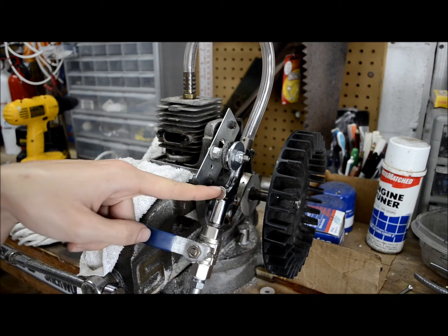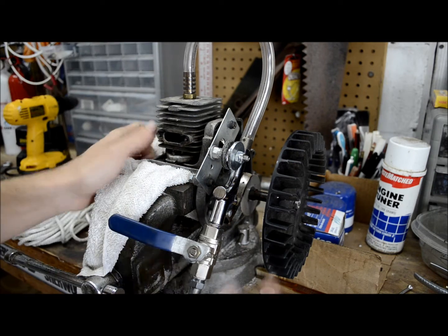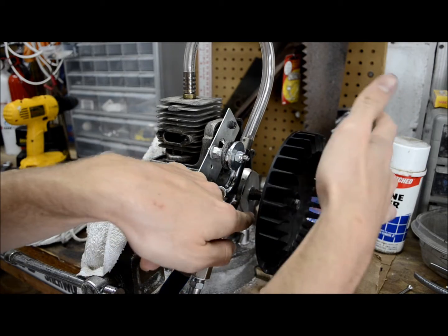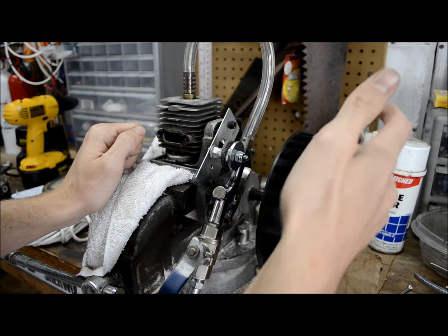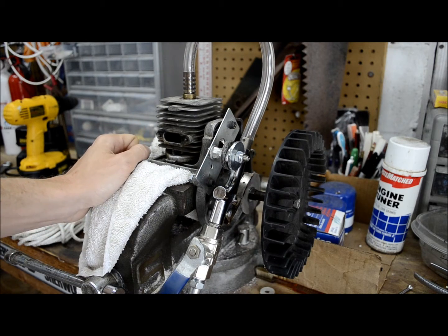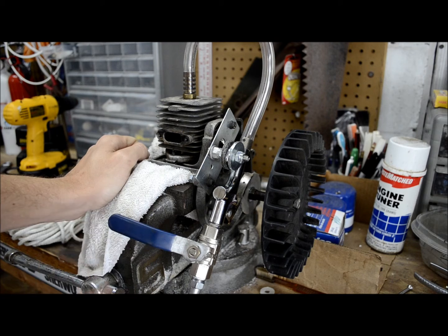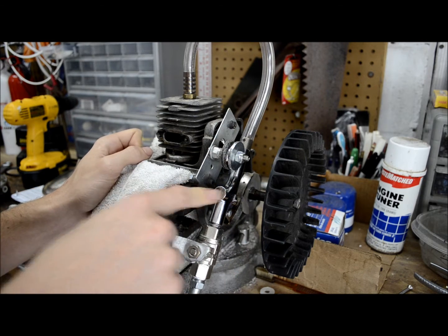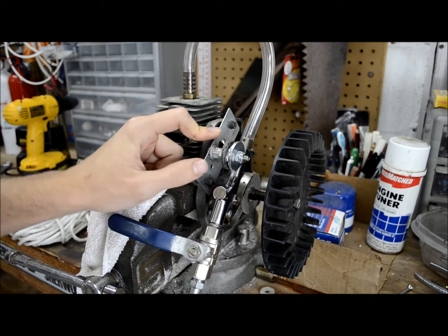Here's basically what we have: a little compressor blow gun that opens and closes at a certain point in the stroke. As you can see, this washer made out of plastic is offset so that it opens the valve and then closes at a certain point. That's what controls the airflow.